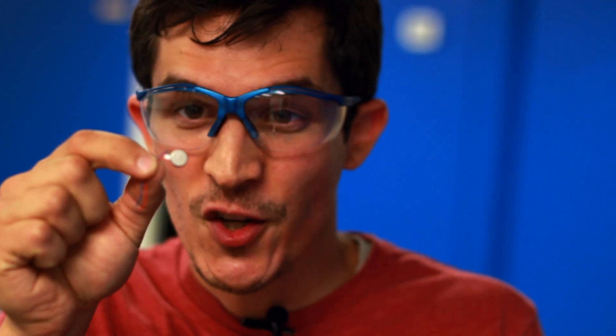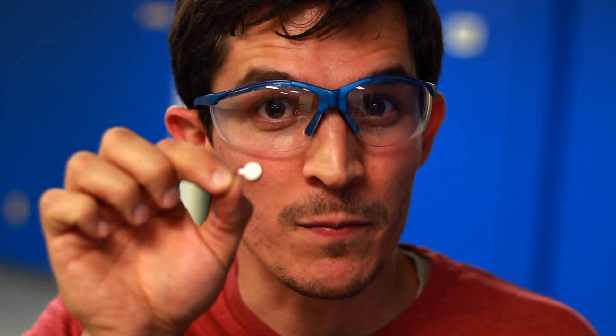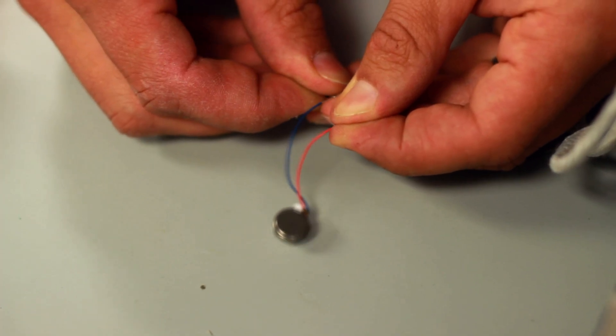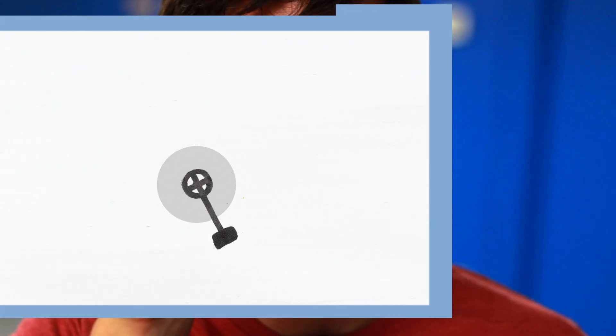Monkey Bruce suggested putting motors inside the shoe that wiggle when power gets applied to them. A really cool thing is that you can buy motors that do this automatically. In fact, you probably already have a few in your house, inside your cell phone. Remember when you set your cell phone to vibrate? There's a little motor on the inside, and here's how it works: as the motor spins, it's actually spinning around a little weight off-center on the shaft. It's kind of like taking the shoe and spinning it around — my arm is like the shaft and the shoe is like the spinning weight. That's what makes it vibrate.